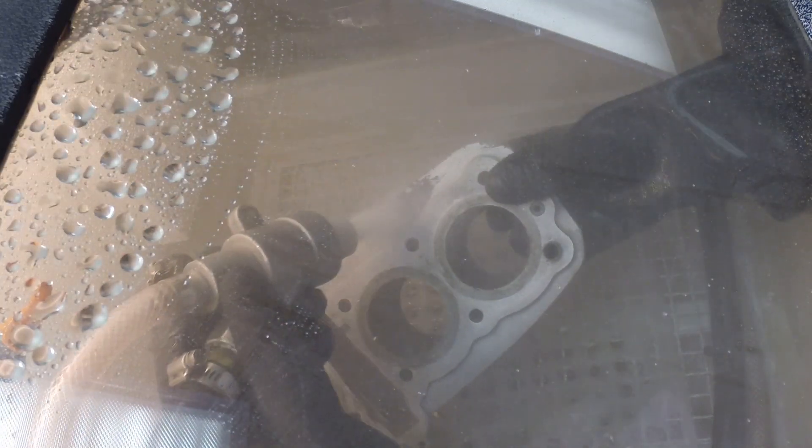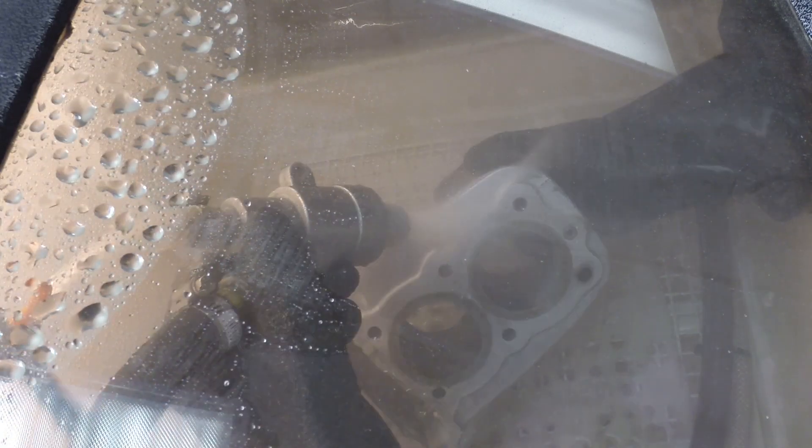The last one is 26 CFM — this thing is like a freaking fire hose. Look at that blast pattern — it just rips all the junk right off as fast as you can move the gun around. I wish I had a compressor big enough to run this continuously. At 26 CFM you're looking at a good seven-and-a-half horsepower compressor, and to run this gun continuously you'd probably need a 10-horsepower compressor.